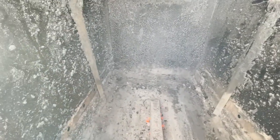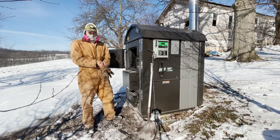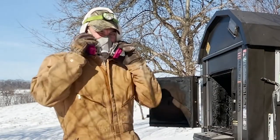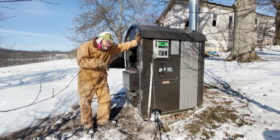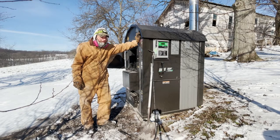As you can see there's a little bit of creosote buildup along the backs; the air channels here are pretty clean, and the ones over here aren't bad either. We're going to make sure that we can have good airflow throughout the furnace. I'm going to scrape the sides, scrape some of this creosote, and then work on the air holes in the front. I'll take that handmade tool and scrape the sides to get all that creosote off.